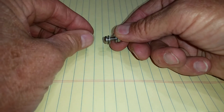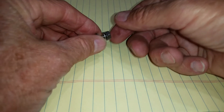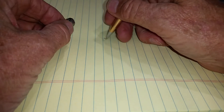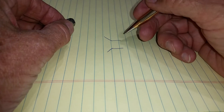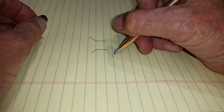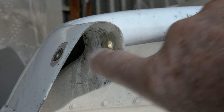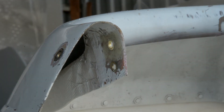What that does is it bends over the last part of the ferrule. So after the countersunk step, the ferrule looks like this, and then when you do this next step, it folds over like this. That's the back side of the ferrule — you can see it's completely flat and bent over, just like the other one, and we're good to go.